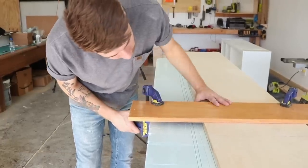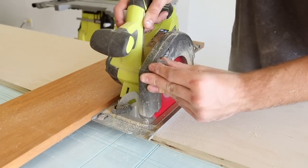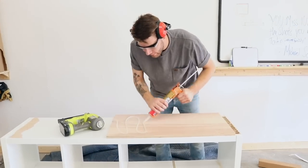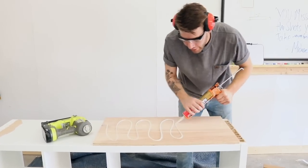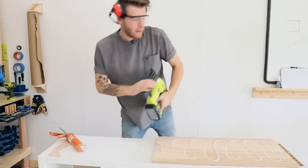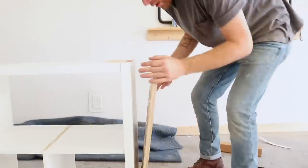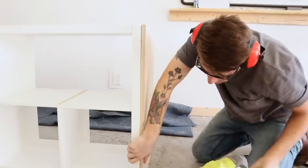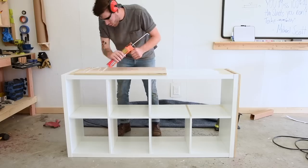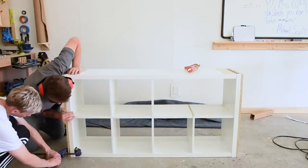I started with my two sides. Here you can see me clamping a straight edge to use with my circular saw — that way I got really clean cuts. To attach these panels onto the sides, I'm going to use an adhesive called liquid nails. It's really strong and pretty much attaches to anything, but we need to put some nails in it to attach it while it dries. Brad nails are super quick and they leave a really small nail hole that you can fill with some wood filler really quickly and easily. But if you don't want to do that, you can always just clamp your pieces to the shelf and let them dry overnight.